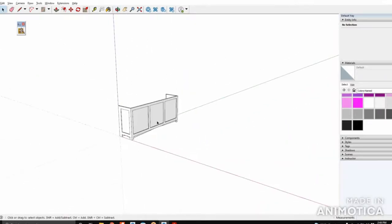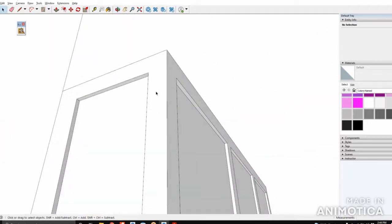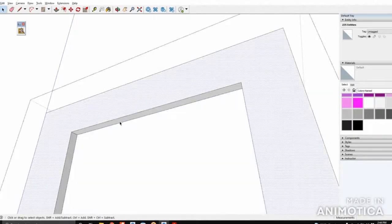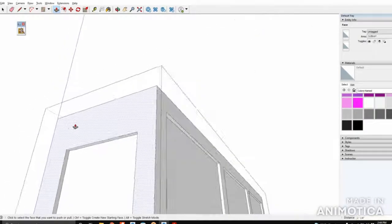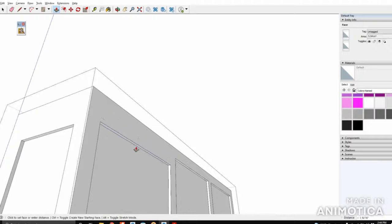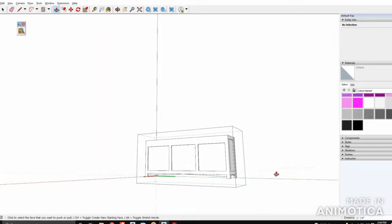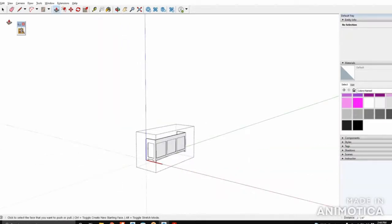But I also have a chair rail that's going on this, and I want my stiles and rails to have equal reveal all the way around. So my chair rail I know is 2 1/4 inches. So what I'm going to do, enter that component again, I'm going to hit the bottom edge of my top rail and push that, and I know that my chair rail is 2 1/4 inch tall, so I'll come down here, and while I'm pushing I can refer to that face. That'll make them flush. So there, and go all the way around. And there we have that.